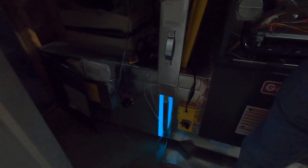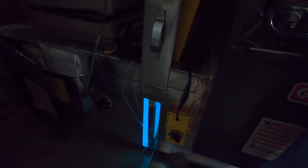We actually want that light to kind of bathe the media surface so germs and viruses held there are exposed to the ultraviolet light. My UV light is installed to shine on my filter right there and I haven't noticed any breakdown — this person just has a different filter type. They're using a paper-framed or light cardboard-framed filter, whereas mine is a metal frame. Over time — and I'm talking years, decades — on mine there is a little bit of plastic on the micro power guard and the only deterioration is that the surface isn't shiny; it has a dullness to it, not really breaking down, just affecting the aesthetics — a dull, rough texture — simply from exposure to the UV light waves.